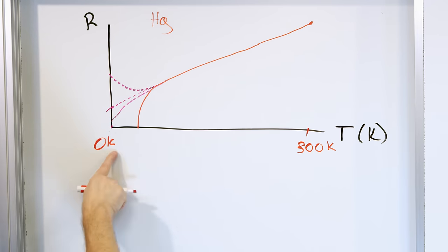You put a platinum wire here and a platinum wire here and a platinum wire here and a platinum wire here, and you spread this indium metal on top of this platinum wire. So at the end of the day, under the microscope, you're looking at four contact pads, four wires coming out, and you connect them to a measurement device, and then you slowly cool it down by slowly lowering it in liquid nitrogen. And every time you drop it down closer and closer to the liquid nitrogen, you measure this resistance, and then you get a graph that looks just like this.